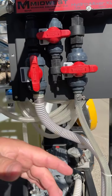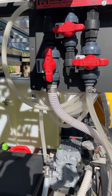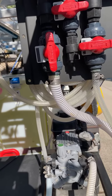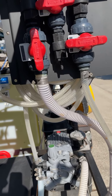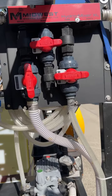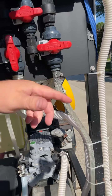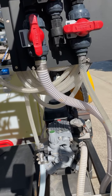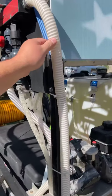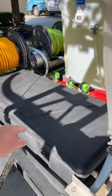These are three-quarter inch and I feel like it kind of starves it a little bit. Panhandle Power Supply has a one-inch — it's the high flow, it's like $625, so it's also a better deal with bigger flow. We have a half-inch recirc line, the water line. We don't have soap hooked up yet, we're just mixing soap into our tanks. We have a one-inch line from here to the machine and a three-quarter inch line from there to the reel.